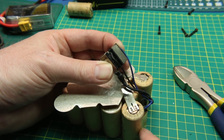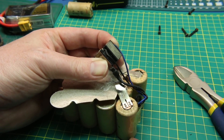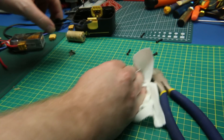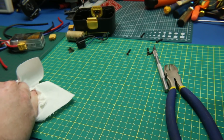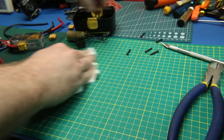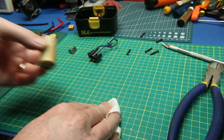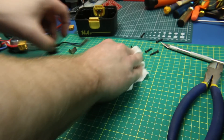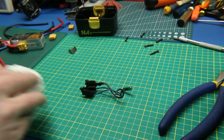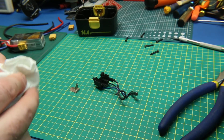That's the right thing to do. We could jump it out or leave it open — I'm assuming it's probably normally closed — but let's just reuse it. That's separated. Get all this shmoo out of here, that's from leaky batteries over time. Not pleasant. The soldering iron's warming up, we're ready to go. Dispose of these cells carefully — they are still quite powerful in some cases and that pack is actually charged. I will submerge it in some salt water. Just put it in a bucket of salt water and then take it to your local recycler.